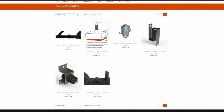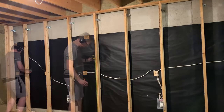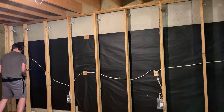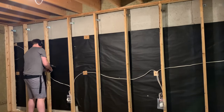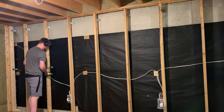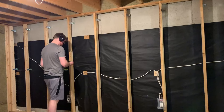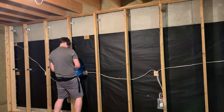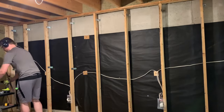In the end I was able to get all the DE90 I needed for just over $600. In total I needed 72 DE90 clips because this product needs to be installed in a two-foot by four-foot grid in order to hold the weight of two layers of 5/8 drywall on top of the framing. The instructions were very easy to follow and I rented a hammer drill from Home Depot for the concrete sections. Once I got the DE90 installed I could focus on ensuring that the framing was fully disconnected from the rest of the house, apart from the concrete slab.